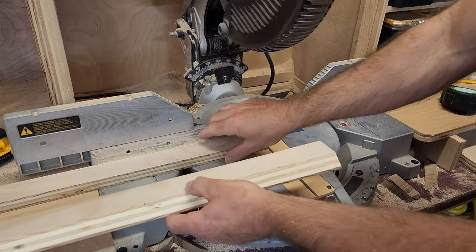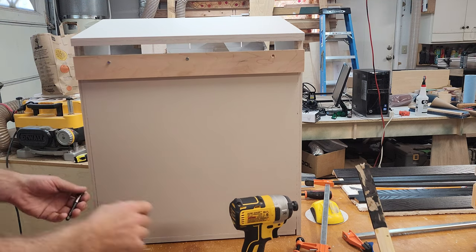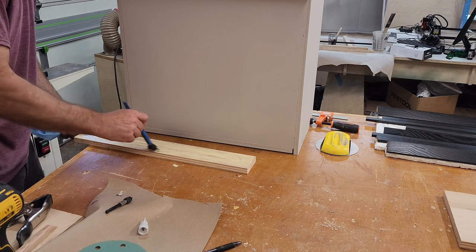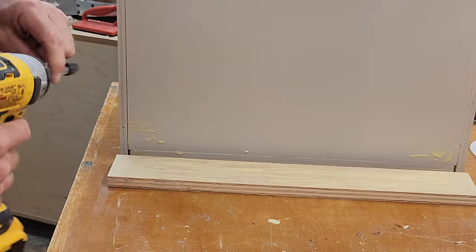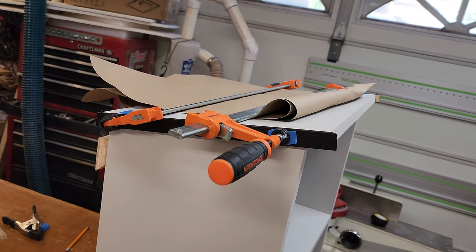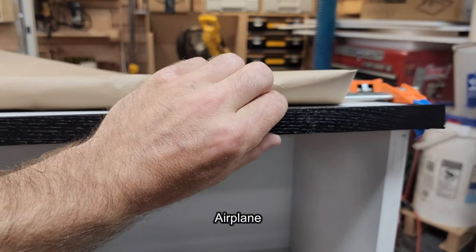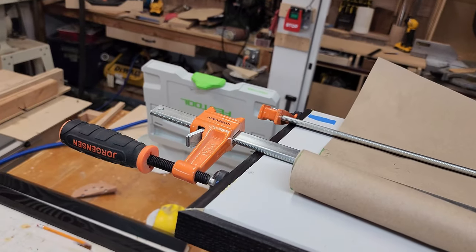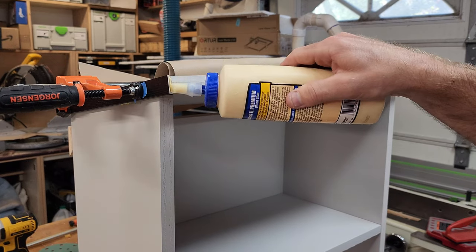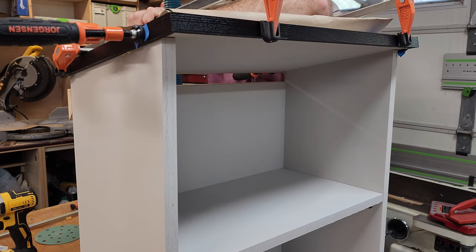If you're not familiar with how a French cleat works, it's usually two pieces of plywood with a 45-degree cut in them so they can lock together and hold nice and secure. The plywood cleat is three-quarter inch ply, and there's just a piece of the same ply as a spacer to go on the bottom. The way I do these miters is I put the edge trim on first, then do the front and just trim it very slightly until it matches up on both sides. I really wanted to put as few nail holes in this as I could — most of it was just glued and clamped on, with a few nails where needed.